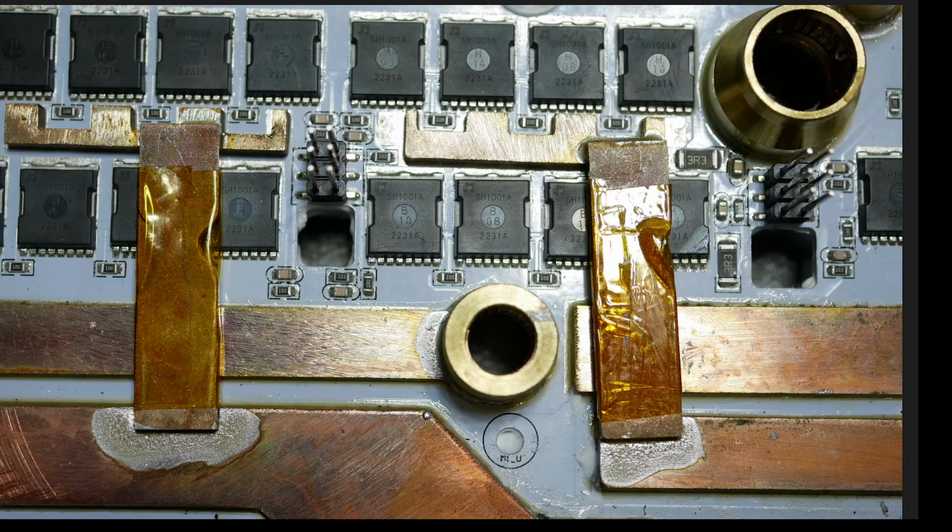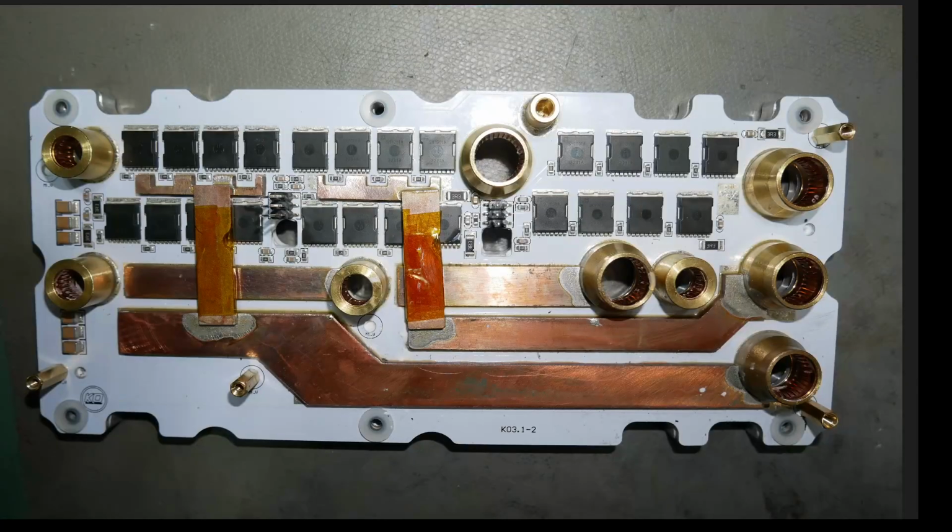Holy cow. Nice big gap in the battery minus bus. Yeah, typical KO Moto shitty ways of doing everything. Holy crap, everything is awesome. Super cool. All right, so here is your entire upper power stage. I hope that this inside here is thermal paste. I don't know what that is. I will stick a Q-tip down there and see. Hopefully that stuff comes out. But yeah, you definitely don't want something insulating the little copper fingers from the brass stud.